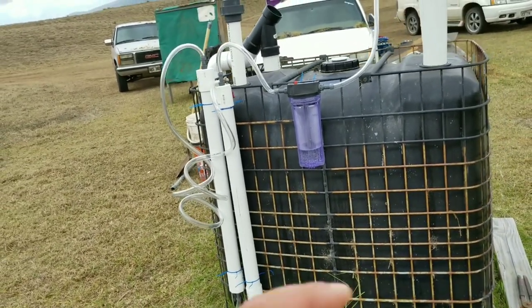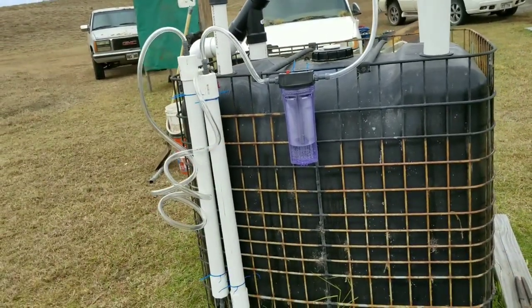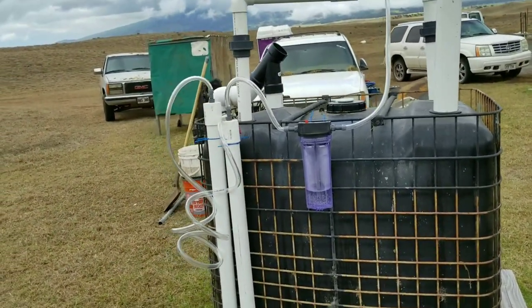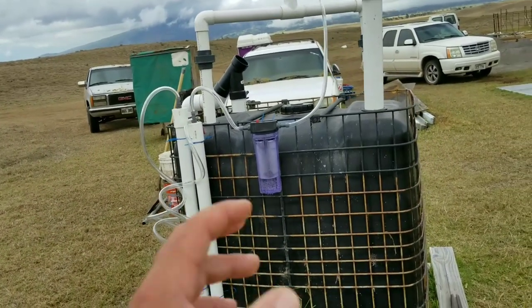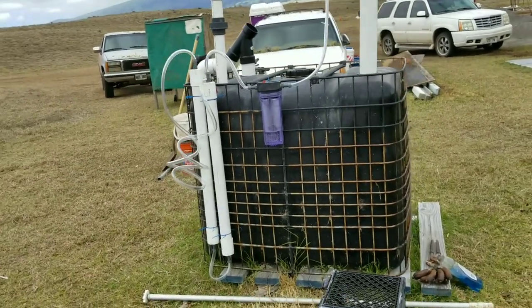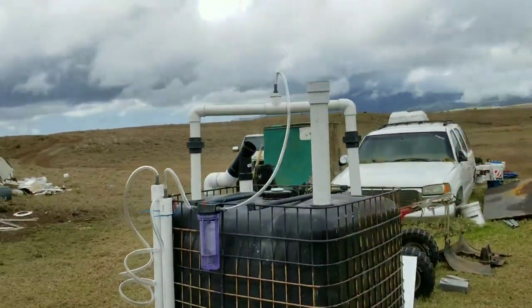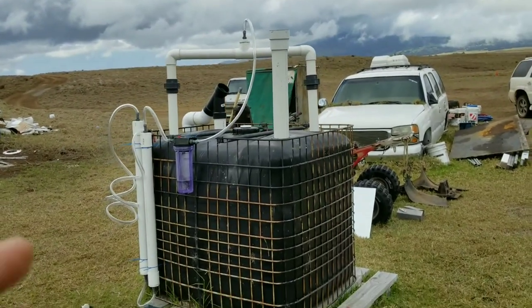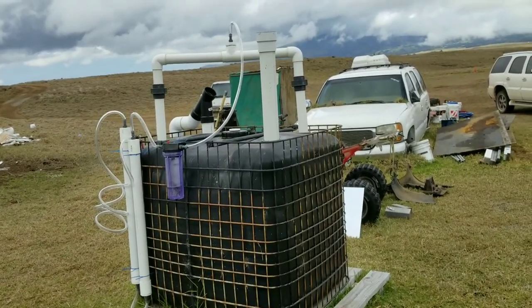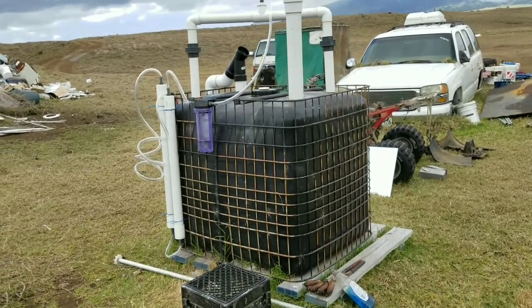I may add one more tube, but instead of steel wool I might fill it with clay balls used in hydroponics. Clay is good at absorbing water and moisture but also dries out quickly, so it would be one more stage of cleaning and drying the gas. You could keep adding stages or just use it as-is. Anyway, thanks for tuning in — I'll give you more progress once we have a flammable flame again and I'll show you what I'm going to do with the gas.